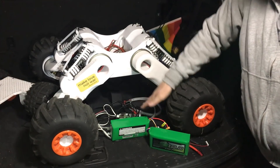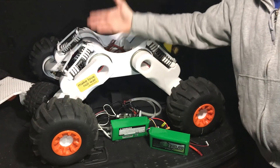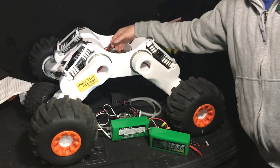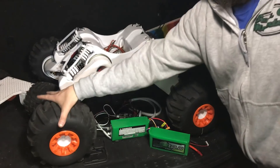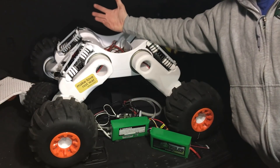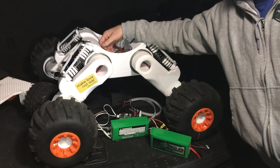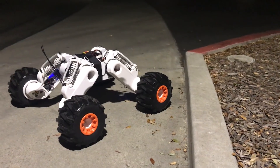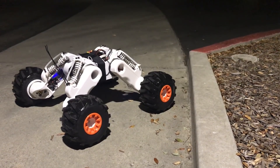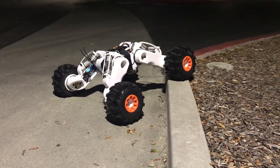The bigger step was a challenge — we were rubbing right on the inside, so you could change the ride height of Rover with longer springs, that would help. The inverted slope was just ever so slightly inverted on the stair. I'll show the articulation of the suspension — you can see it articulates nicely. Going up the stairs I went mostly straight at them, but it can go at any arbitrary angle. This curb is a perfect example where the articulated suspension is really helpful — Rover can keep all of its wheels on the ground while going over rough terrain.